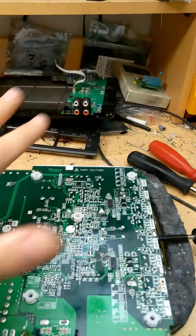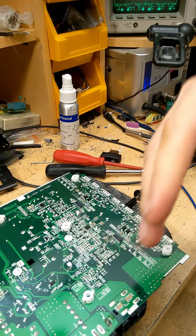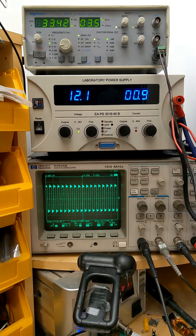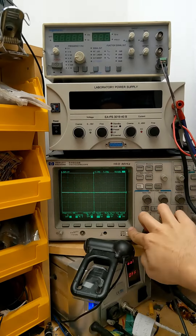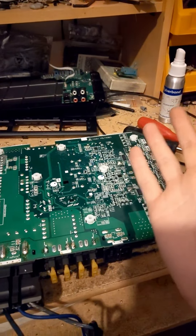We now know there's a very gradually and intermittently failing semiconductor component in this area - with heat it starts working. I'm going to let it cool down and spray some isopropyl alcohol to cool it quickly, and see if the issue returns. If it doesn't return, I can't pinpoint the faulty component. It seems to have cooled off but it's still switching - this is going to be annoying. The best thing is to shut down the workshop, play some Legend of Zelda, and come back tomorrow to give the board time to fully settle.